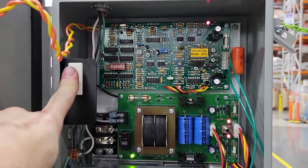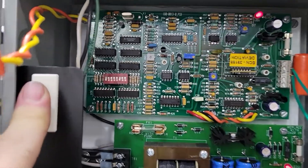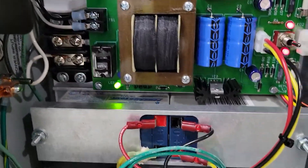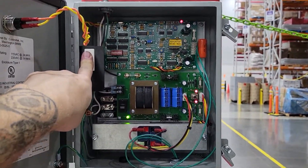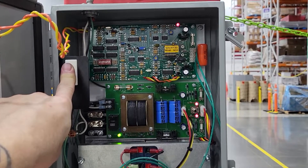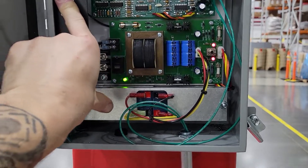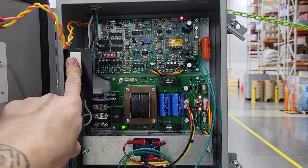This is the old-school design — there have been two designs of this thing, and this is the more recent one. Old school just works sometimes. It also has a battery backup in it, so in case there is a power failure, you don't get a whole bunch of forklifts that just freak out when it loses the wire. I'm opening the box right now — this is a safety deal, so when you open the box it disables the high voltage in here, which kicks the battery backup in. It's nice to keep that closed as much as possible to use the batteries as little as possible.